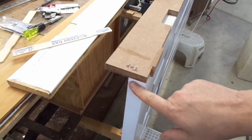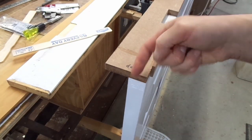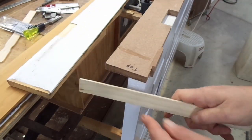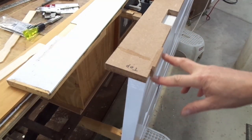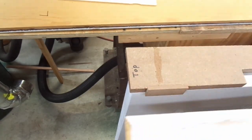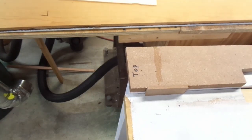Because the door is at an eighth-inch offset sitting below the top of the frame, on the door side you align the jig to the overhang of the door with the gap you want — in my case about an eighth of an inch. I'm using a paint stirring stick as a spacer. By lifting the jig up an eighth inch, you're effectively lowering the door an eighth inch. As a sanity check, bring the door frame into the picture and line up the pencil line with the top of the jig — you can see the door is hanging about an eighth inch below the top of the door frame, and I can corroborate that the hinges are lining up where they should be.